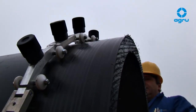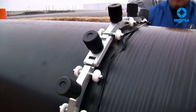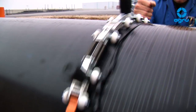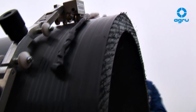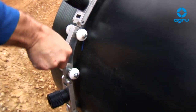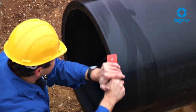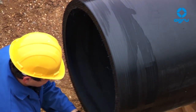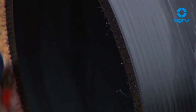Due to the big tolerance range of pipes, it may be necessary to repeat the scraping. In order to avoid multiple try-ons, we recommend measuring the pipe's diameter prior to the scraping. It is important to have a small annular space. Do not repeat the scraping to remedy installation problems due to ovality. Damages within the welding zone, such as grooves or scratches, are not permissible. Chamfer the pipe's outside end with a hand scraper to enable better installation of the e-coupler and to avoid damage to the wire. The pipe's inside end should only be deburred.